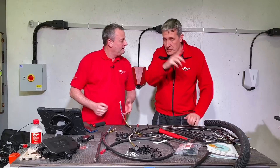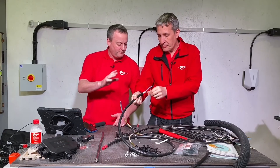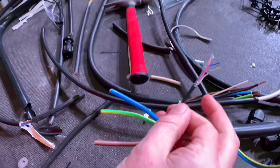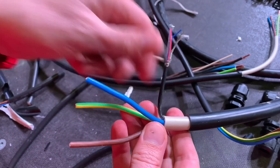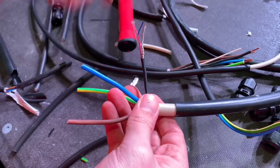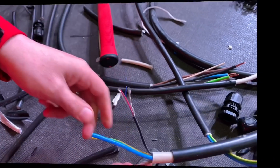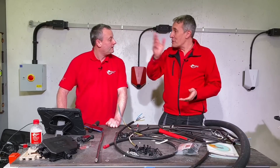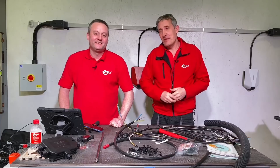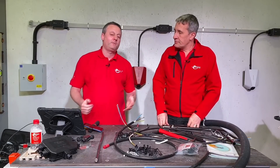We think tough sheath is almost the perfect cable for most EV charger situations — hugely popular. We also visited the Doncaster Cables factory to see them making the EV Ultra cable. It has an additional twisted-pair data cable included, which you might use to hook up a current transformer for load shedding or load mitigation. There's also a version with Cat5 data cable for ethernet or multiple current transformers. EV Ultra is available both with steel wire armor and in the tough sheath version without armor.